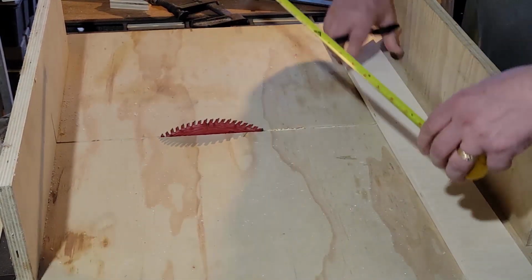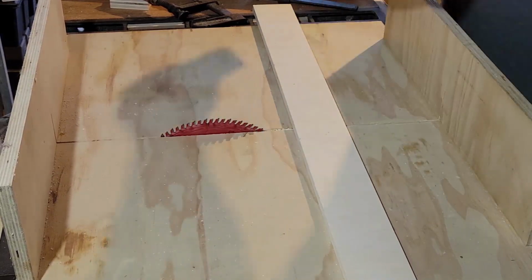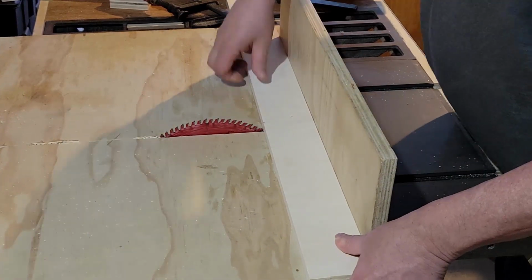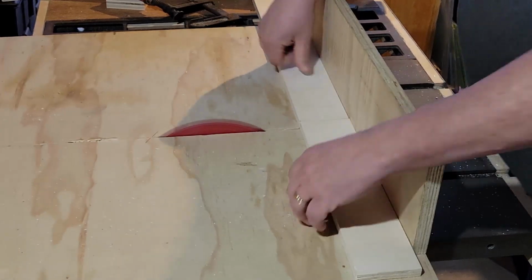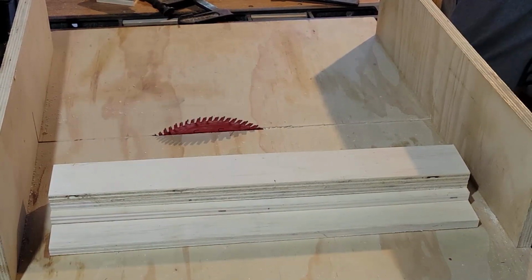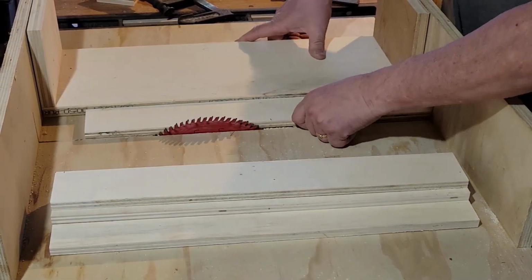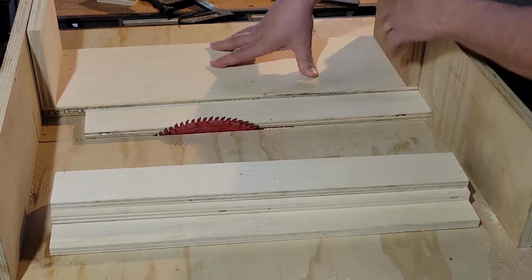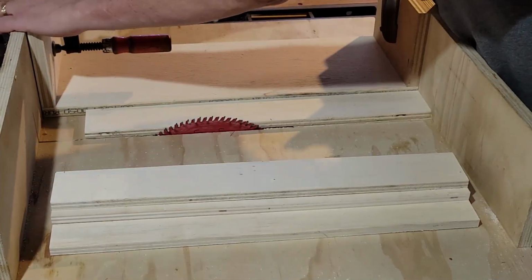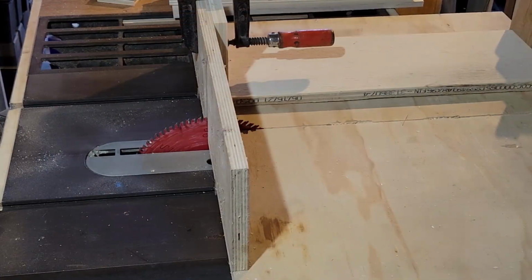So I have that access panel, and I have to be able to fit it to basically just a gyprock ceiling with stippling, and it is a very difficult sort of thing to figure out as far as how much of a hole there should be, and of course how much tension that spring is going to have, because it's a cheap access panel. It has a relatively weak spring, and I wasn't entirely sure how big to make the hole. So the easiest way of doing this would be to create a frame. It's basically a picture frame, but the picture frame is not going to be pre-assembled. I'm going to go on site and attach this to the ceiling, and it's going to have some adjusters on it that are going to allow me to fiddle around with the tension a little bit and make sure that the access panel stays up and doesn't fall down.